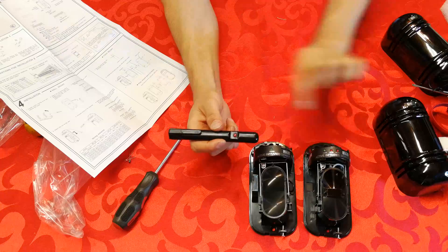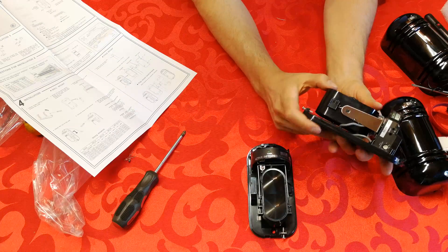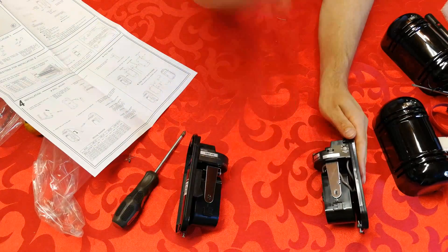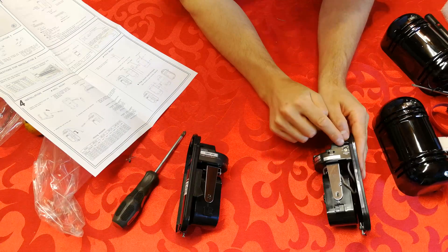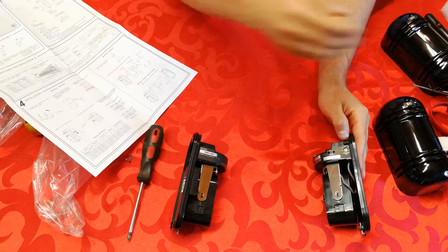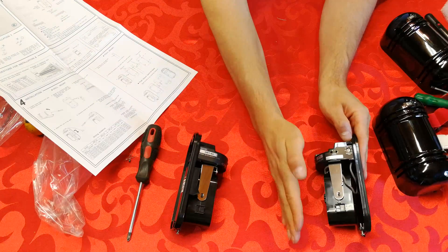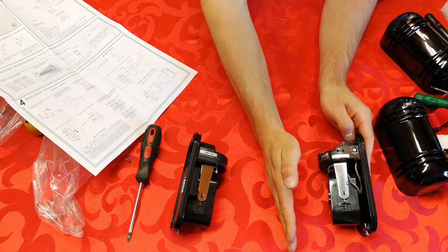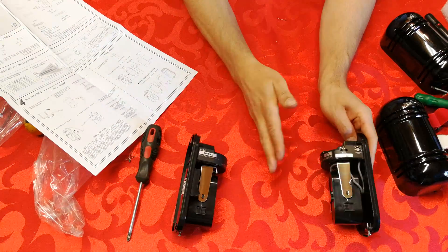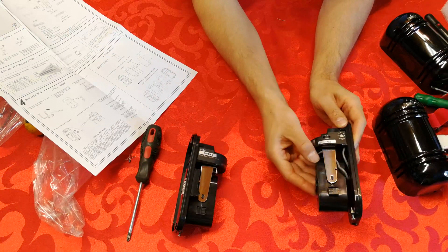When I do alignments I use a laser pointer on top of a spirit level to get a level shot. There is a response time potentiometer — a variable resistor — that lets you adjust how long something needs to break the dual beams before the receiver triggers. This reduces false alarms; a bird flying past won't trigger it if set correctly. I normally set this during a walk test.